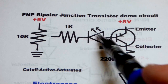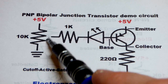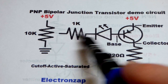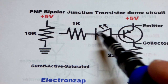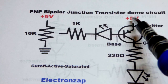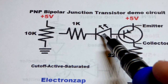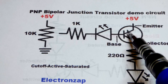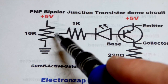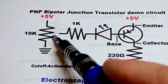To get current going, we put the LED in the correct direction with the cathode going to this resistor. This one-kilohm resistor is a current-limiting resistor, because we can set the trim pot all the way down to zero volts, giving us five volts across that resistor. We need at least about 1.5V for the red LED and about 0.6 to 0.7V for this diode junction — so we need to go at least partway before any current flows.